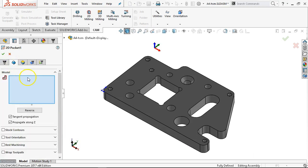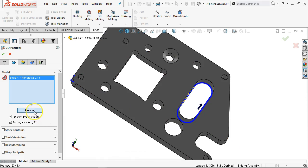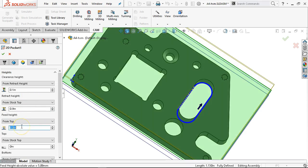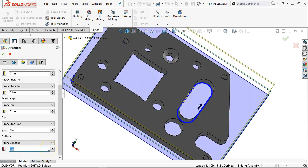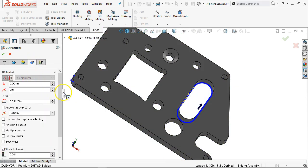I have all of our numbers from the tool library. The model will be the bottom — making sure that the arrow is on the cutting side. If not, reverse it — making sure it's interior to make the cut. We're going to go with our same numbers: 0.1. From contour, maybe minus 0.005. There's no finish on the pocket yet — we haven't told it finish passes.